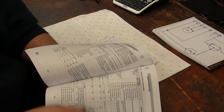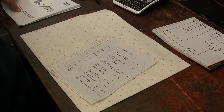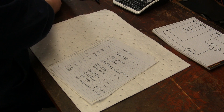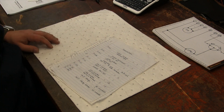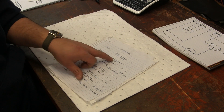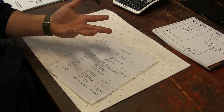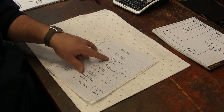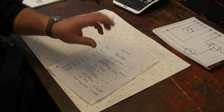I'm just going to try to keep it simple for demo and instructional purposes because that's really all you need. You could really rack your brain going through that manual - there are so many different parameters to choose from. So, starting source: terminal strip. The next one is going to be the speed reference - how is the VFD to accept speed values? On the VFD it's got a pad up and down to change the hertz, but we're going to set this to a VDC pot which is our speed control.